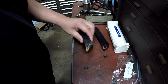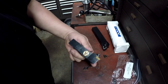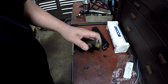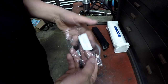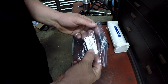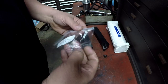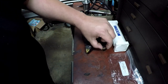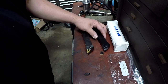I was also wanting to try another DNMG insert — one that I got from a viewer. I grabbed a couple of different style inserts. This is another one of the inserts that Dennis had given me — it's a TP2500 grade. We're going to give it a shot too. But I'm going to try the WNMG first and see. And like I said, we may have to do some welding on it to support it.